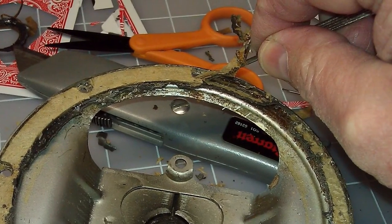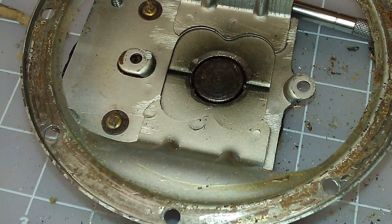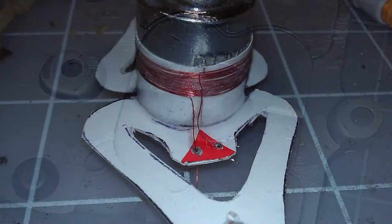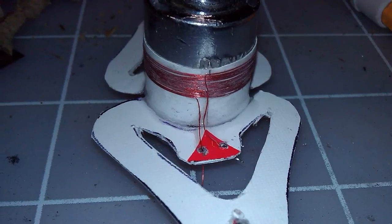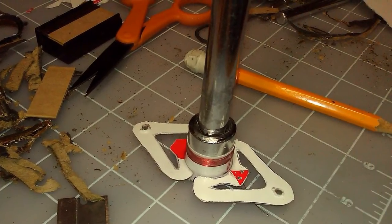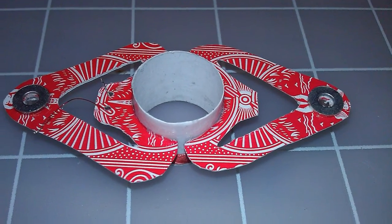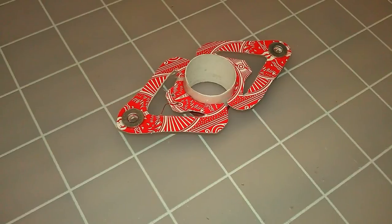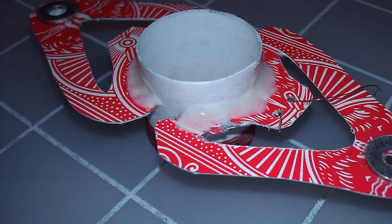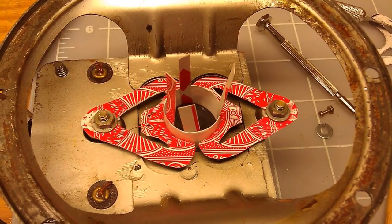After reproducing the spider, I cleaned up the speaker frame, removing all of the existing cone, etc. I then cleaned around the pole again using double face tape, blew it out with forced air numerous times and repeated that process. Next, I attached the spider to the former and, measuring the coil height, did my best to have the coil set centered between the bottom and top of the center pole. I initially used super glue to attach the spider to the former, and then once it dried, I applied my glue mixture mentioned earlier just for reinforcement. Here's a photo of the voice coil in the centered position with shims installed.